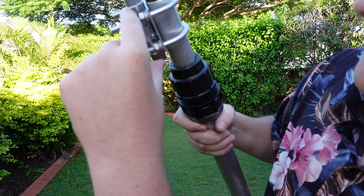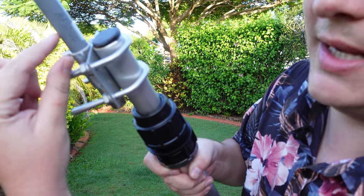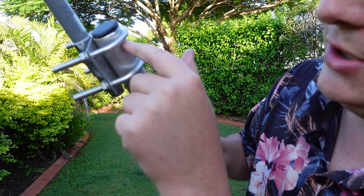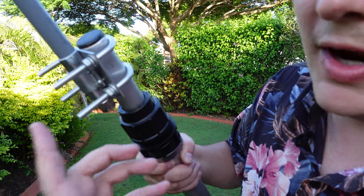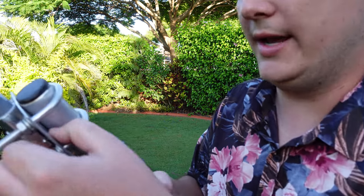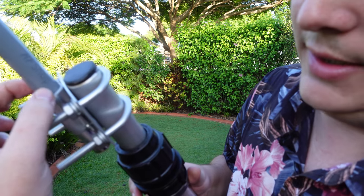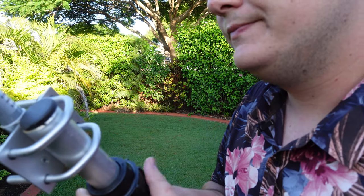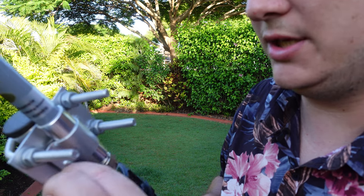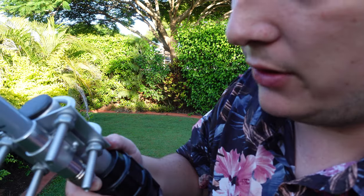What I mean is: if this antenna was pulled down a little bit and I had a portion of the fiberglass part occluded by the metallic pole or the backing plate, that's not good — that's going to negatively affect your signal. The thing you want to look out for is making sure the radiating element is up and above any part of the metallic mounting hardware, including the mast. Also, don't overtighten anything. Make sure you're not occluding any of the antenna with metallic objects. That's all.